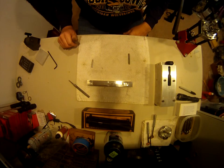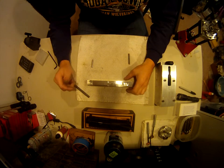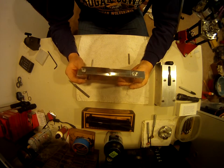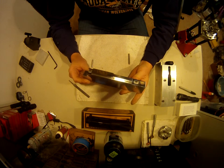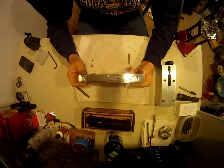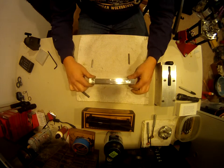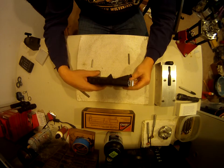Today I want to talk to you about some fixtures that I use when I'm building or machining out AR-15s. I had a different upper receiver block to lock into a vise to tighten down the barrel nut, but I wasn't really happy with it. So what I did was I took some 1 inch by 2 inch bar stock aluminum and I made a new fixture so I can lock it in the vise when I need to tighten down the barrel nut. Anyone can make these if you have a mill, but I'll show you how it works here.